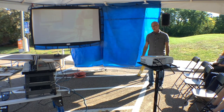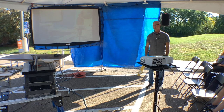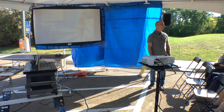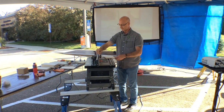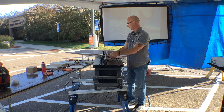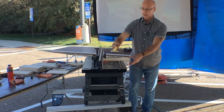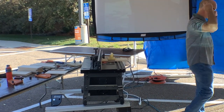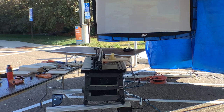All right, so theoretically, we're ready to go rabbit hunting, right? Any questions before I make noise? That's going to go there. You always want a push pad, not your hand on that, so you're never passing your hand over a cutting tool. Same with a dado head.